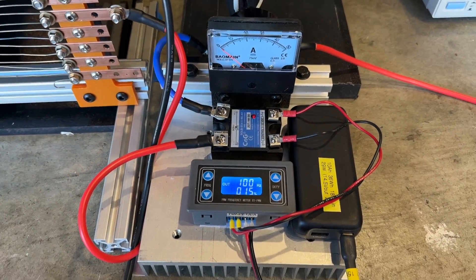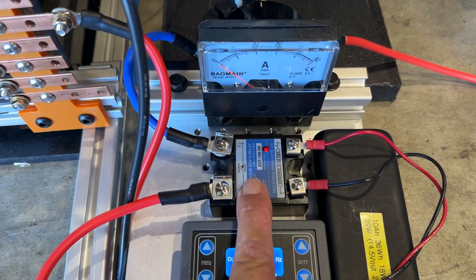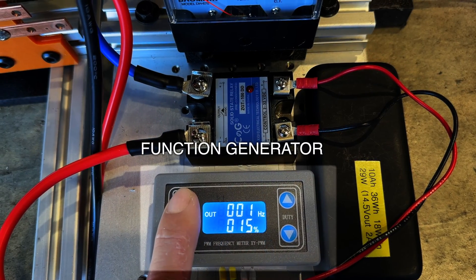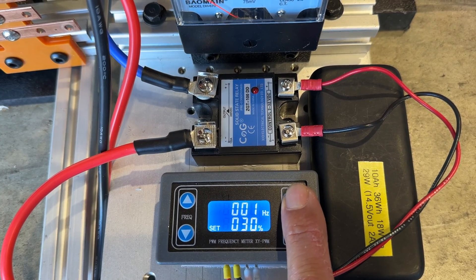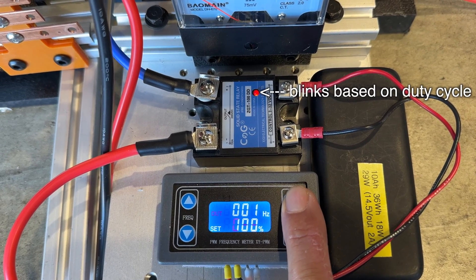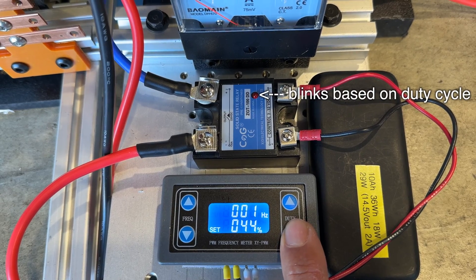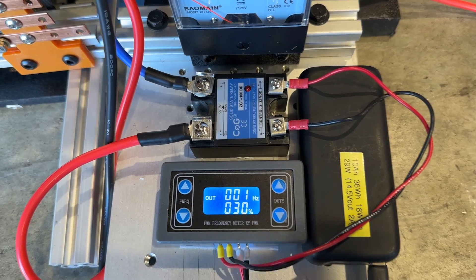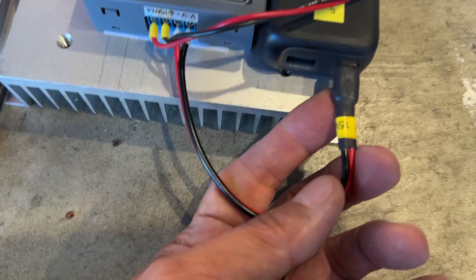The battery is connected to the resistor through this circuit, which is basically a 100 amp dimmer switch — that's a solid state relay. I'm using a function generator to turn the relay on, which will flow current. This function generator allows me to change the switching frequency and the duty cycle; the higher the duty cycle, the longer the relay is on and the more current flows to the resistor. I'm powering all this with a USB battery using a USB-C circuit board with jumpers to select voltage output — I made this one to be 15 volts.